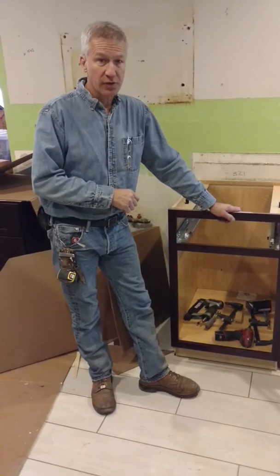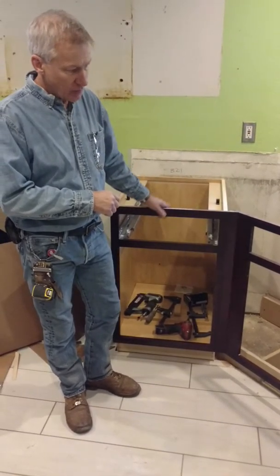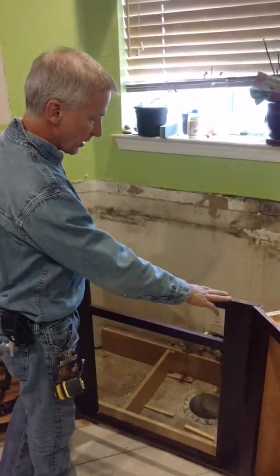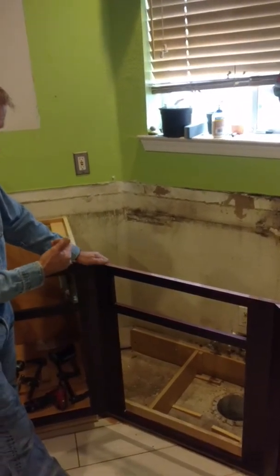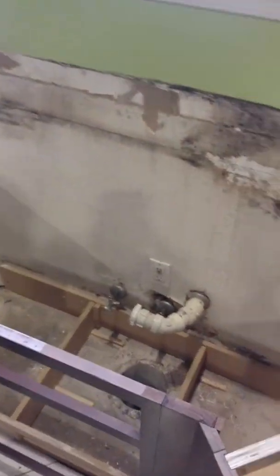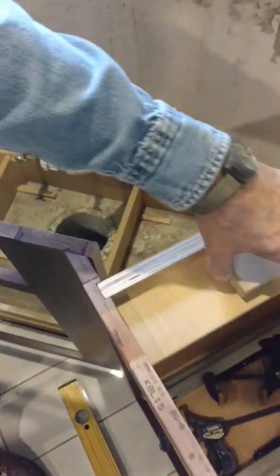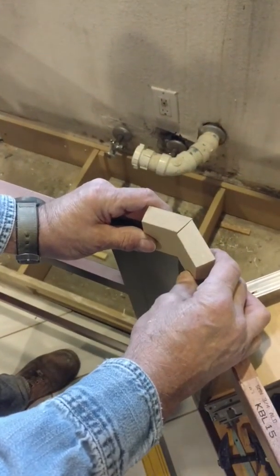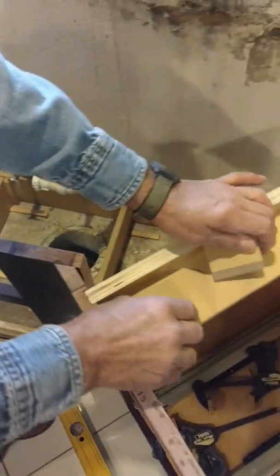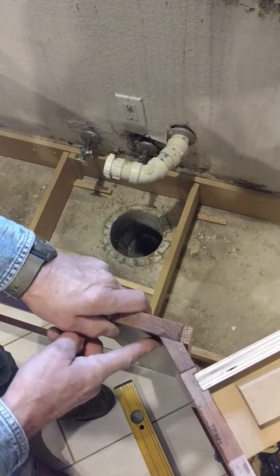On this particular install it was a little bit more difficult because we had to fall back in the same footprint — they were using the same granite tops over again. The first thing I wanted to show you is how we put together this corner. This was just a sink front, they call it — basically a face frame without a box. You have to build a platform on the inside. What I want to show you is how I did my fillers. I did the filler with an overlap versus trying to do two miters together. It's very difficult to do that — there's no room for error. The overlap is the best way to take care of these corners; they come together a lot nicer.